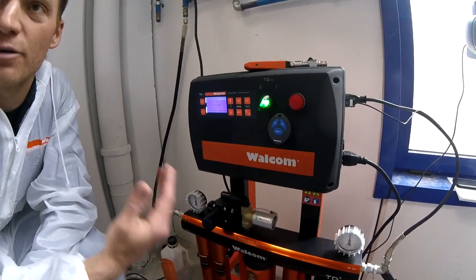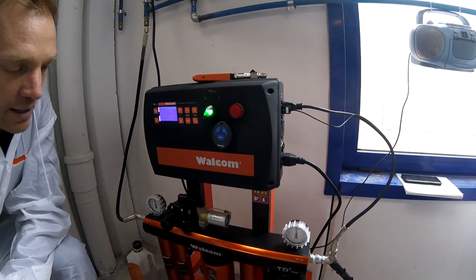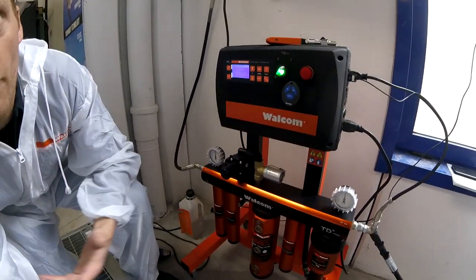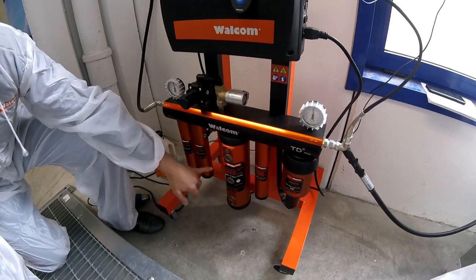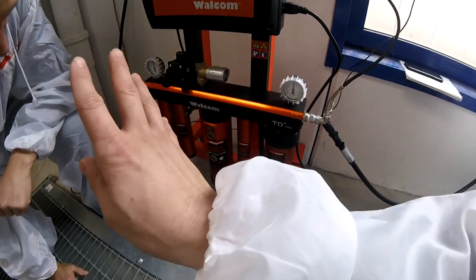After a four-hour cycle, it can be automatic, done once a week, or it can be manual — that's what keeps silica gel in perfect condition. The cycle can be scheduled after hours. It's four-hour automatic, but you can also do it in between lunch break, just 30 minutes depending on the status. Up to you, really. But to do a complete cycle you need four hours.